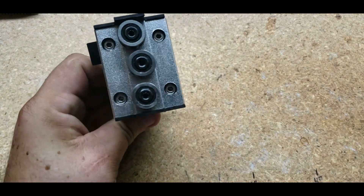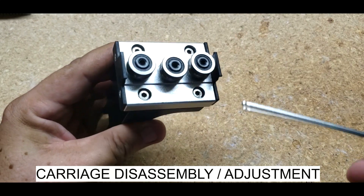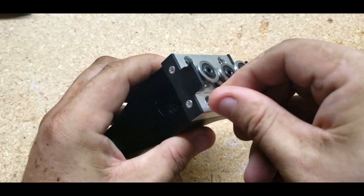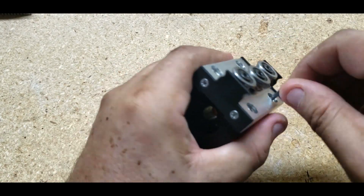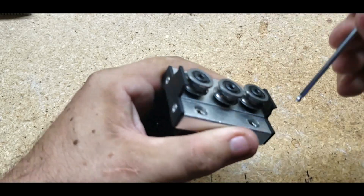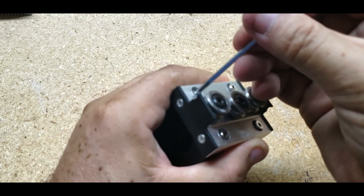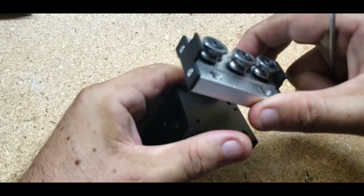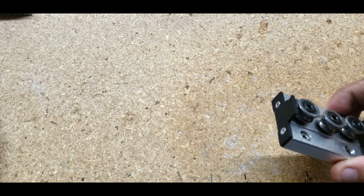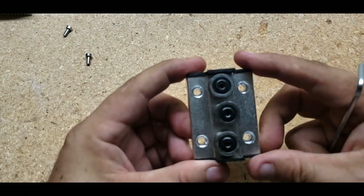To get the carriage piece away from the arm, it's simple — there are four bolts here, here, here, and here. The allen wrench that came with the printer will fit that. Loosen and remove those, then set the arm out of the way. There's our arm — on the gen one the bracket is sideways on the arm. There are four screws in here; dump those out and now we can see all three bearings.